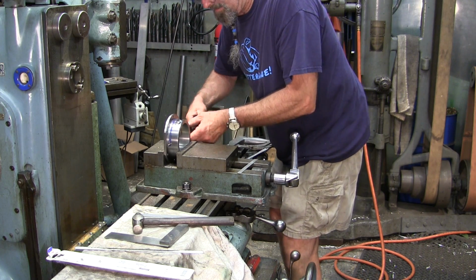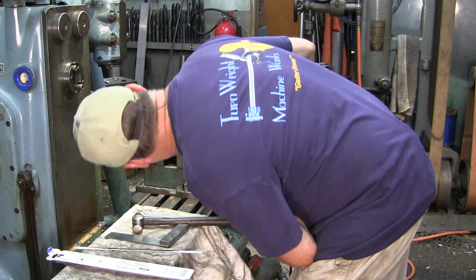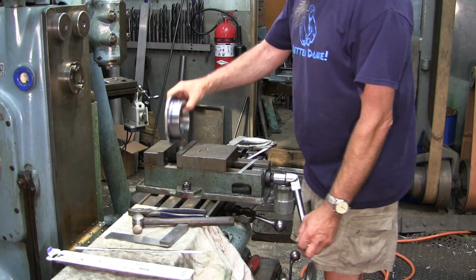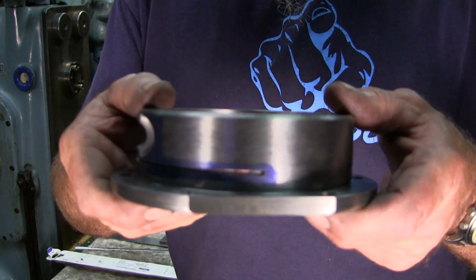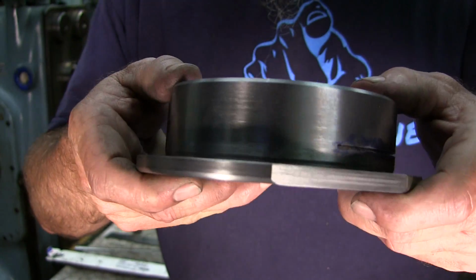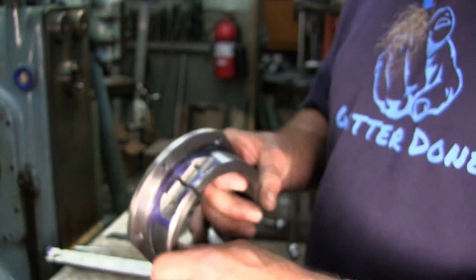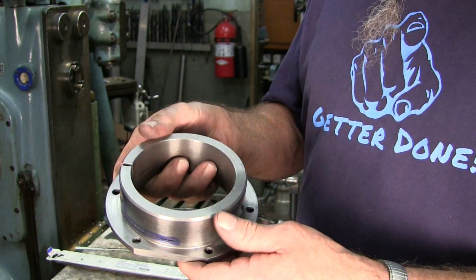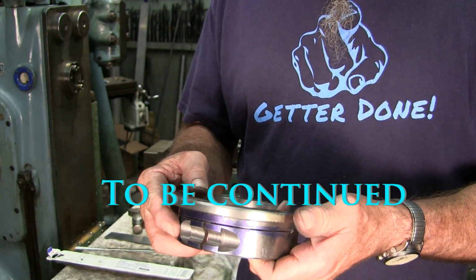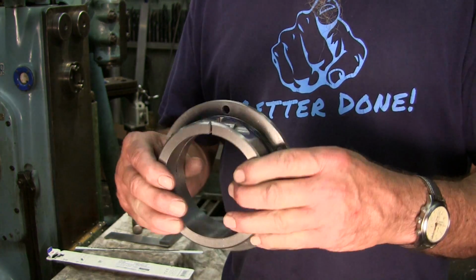All right, let's pull them out and take a look at it now. Okay, we're clean and clear. I like that. Okay, let's see if we can get you a close look up at it. All right, see if that's that side there, and that side there. All right, a little bit of polishing. We can take off our bluing, break all of these sharp edges right here, and I think we're ready to start doing a fit in the housing and check and see how our split line fares out, and grabbing our repair stuff that we plan on doing a repair to that one thread, and getting this done and putting it to bed.